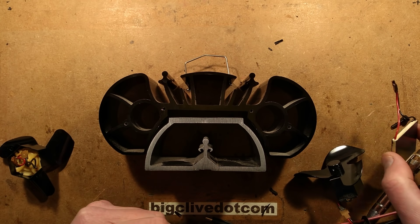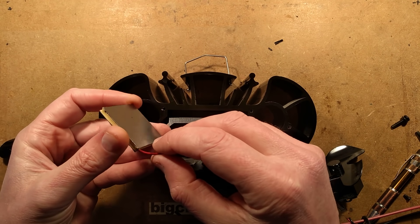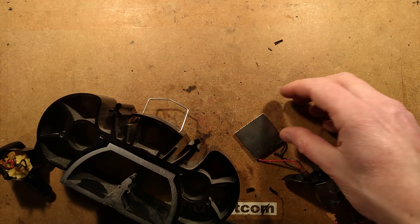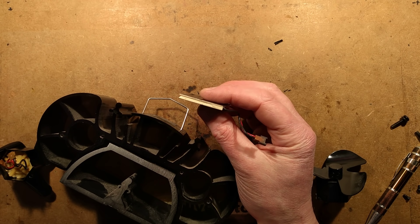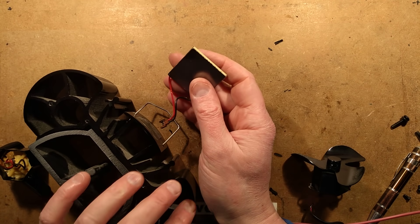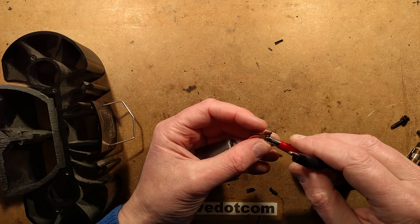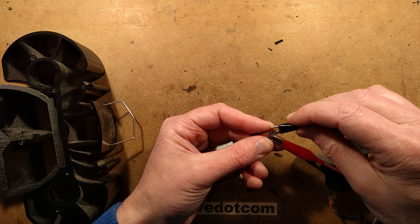I'll have to see what spare components I can find. I'll measure this up because it tends to go by size. Usually these are a ceramic plate and they're usually available on eBay, but the question is whether the ones available on eBay are good — because there's a huge price range, starting at just a couple of dollars and going up to twenty dollars. Incidentally, these plates that generate the power are also capable of cooling: if you apply power across them one side gets warm and one side gets cold. You could technically test that now, though it's not going to be easy to connect onto those terminals. The polarity just changes which side gets hot or cold.